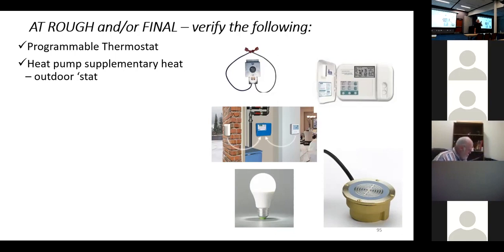So a commercial building now, and we're a little off subject, but I think it's of interest, will have an outside air economizer. And then they'll have what we call indirect evap cooling, where they take cooling tower water that you've cooled through the cooling tower and run it through a slab coil, which adds no humidity to the air. Then you have direct evap cooling, which is a big slab of that cell deck cooler pad. And if you need it, you've got your chiller coil. So we have three stages of cooling literally before we have to turn on the chiller: economizer, indirect, and direct.